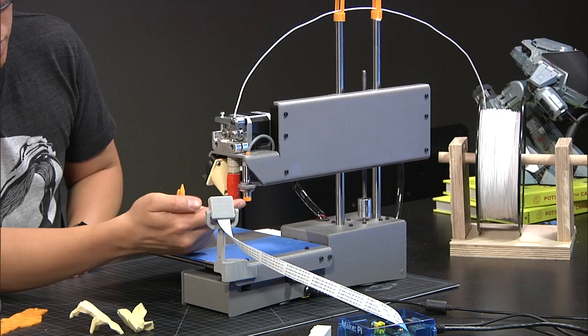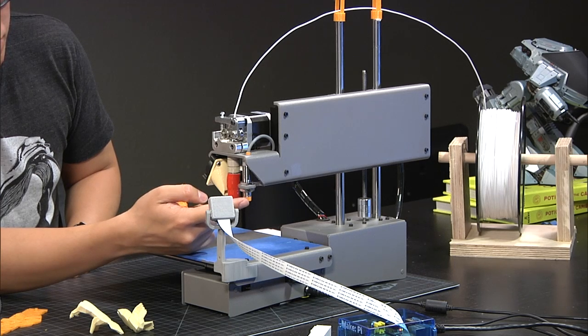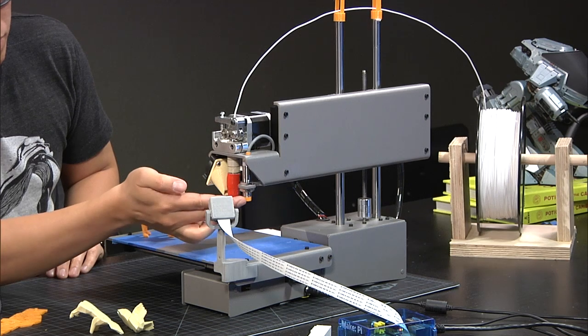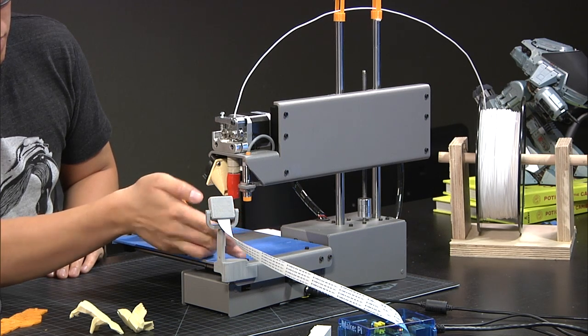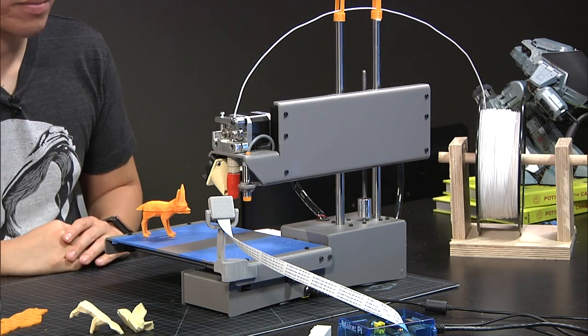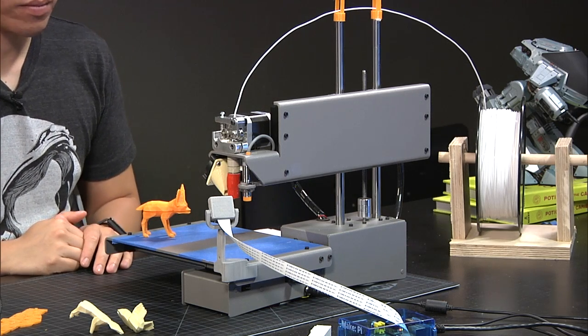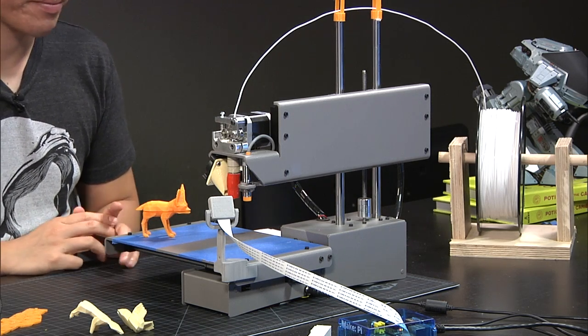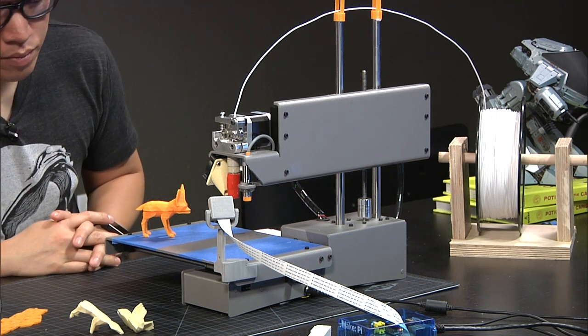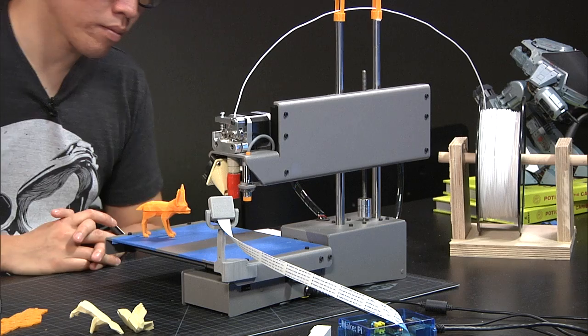That big silver sensor on the side of the extruder head detects the metal in the print bed. So when you get close, it knows, okay, I'm near the metal now. And then using software and a little bit of manual configuration, you tell it, okay, the actual print, where you want to be, is 0.3 of a millimeter below this print head, below where the sensor detects metal.